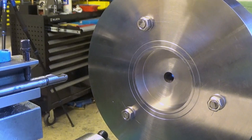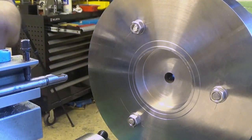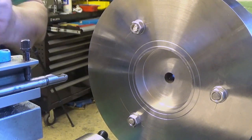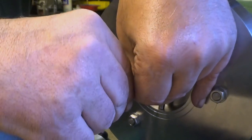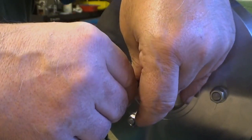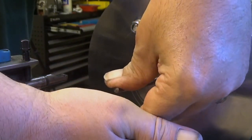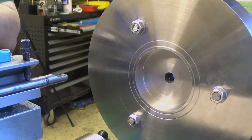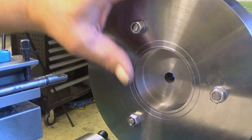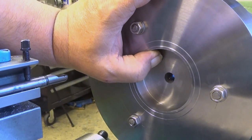Well, let's put one more rotation here and check it one more time there. So 66.91. And this tool is pretty tight, actually. It's a very, very good and tight tool. So you, oh, this might give you a different result now. It didn't go well. Because once it starts to be a taper, I cannot measure it anymore reliably.